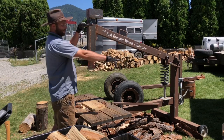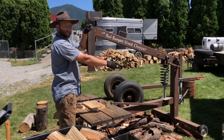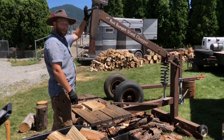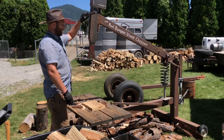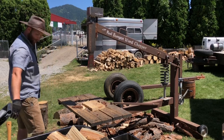This is basically like being able to use a 95-pound splitting maul, because that's what this weighs. But I don't have to lift it because the car suspension spring lifts it for me. All I have to do is move it, and you can see that's really easy. It's just the momentum of all that weight that crashes through the wood.